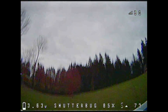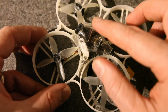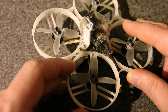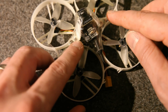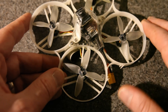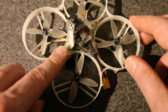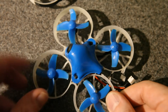There are a few things I want to show you about the build. This canopy is temporary — the real canopy will look different — but one cool thing is that it screws into holes in the frame. The screws for the flight control stack are on the inside, so the canopy does not share any hardware with the stack. That means an impact to the canopy goes into the frame, not into the little pins that hold the flight controller, so it won't interfere with the FC at all. That's a good durability upgrade — actually a recommendation I made when giving feedback on the Beta 75X, and it's cool to see it here. Fun fact: the Beta 75 Pro 2 also has those holes.